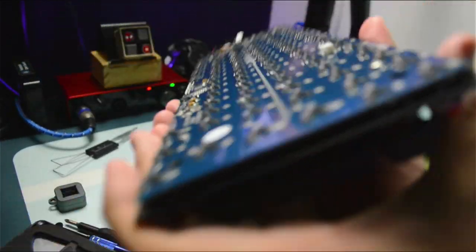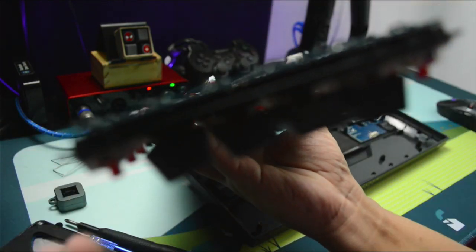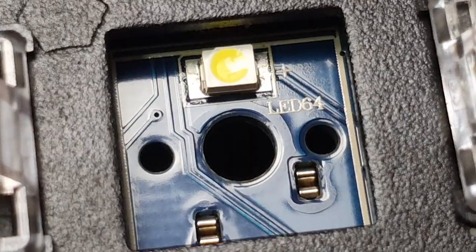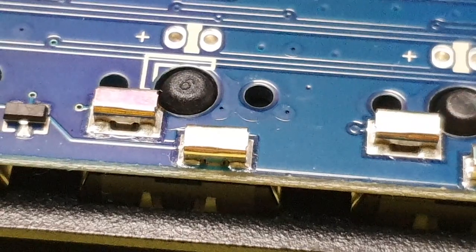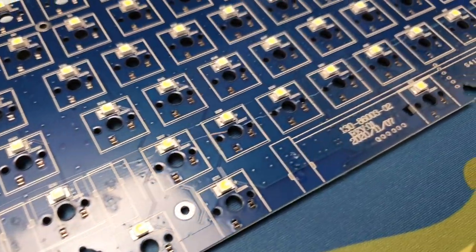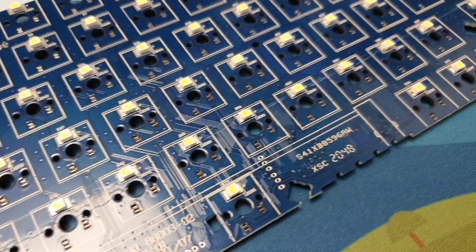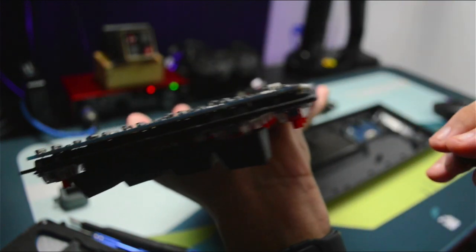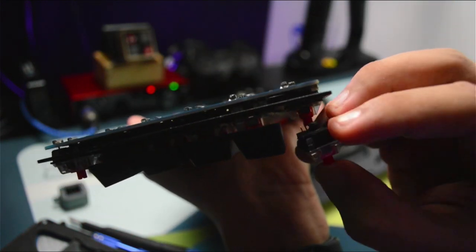two pieces of metal that are soldered on the pinholes. The pinholes have some additional solder around the sockets, and they also added 5-pin compatibility for switches. You'd still have to consider SMD compatibility though, as the light diodes are not flush with the board.